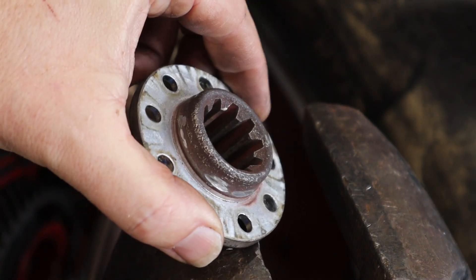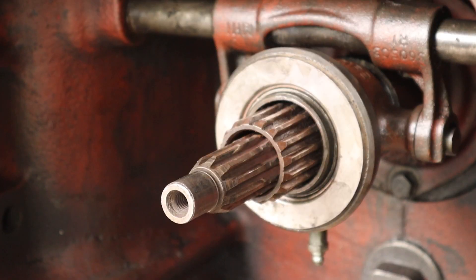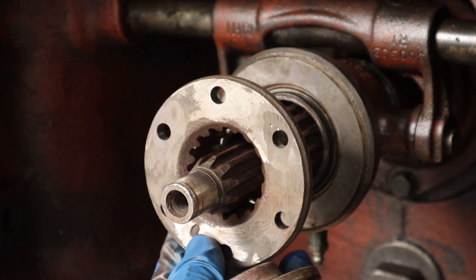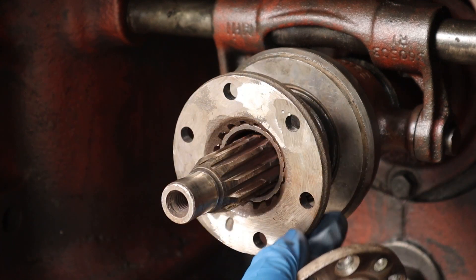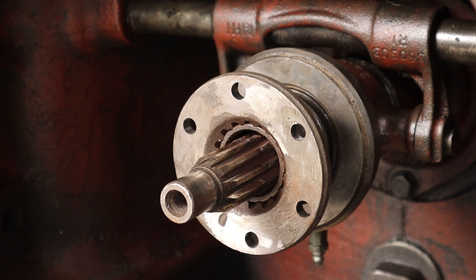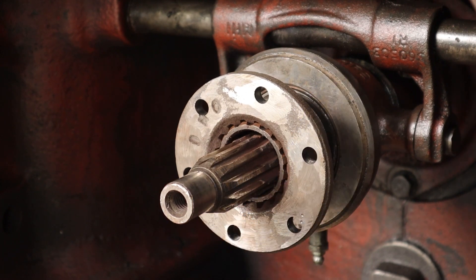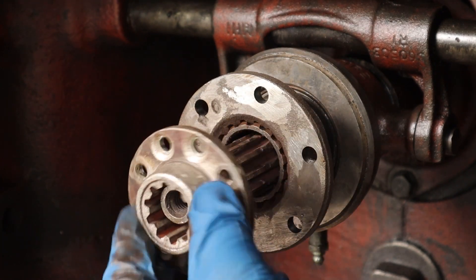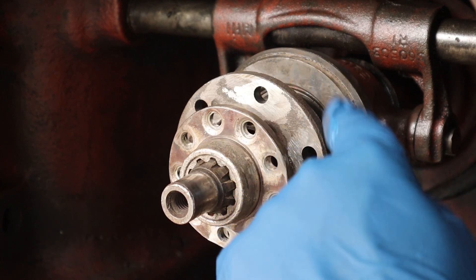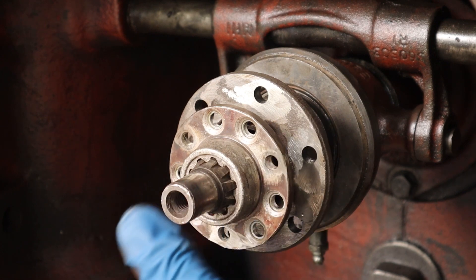So this is what will drive the wheels of the tractor. Here's the input shaft of our transmission. I'm going to put on this part, which came from the clutch cover, which was bolted directly to the flywheel — so this moves anytime the engine was spinning. So that's for the power takeoff. And then in front of that, this is the center of the clutch. So those two parts could spin independent of each other.